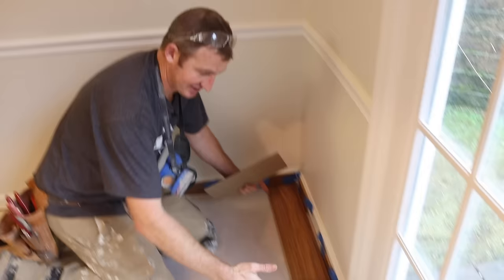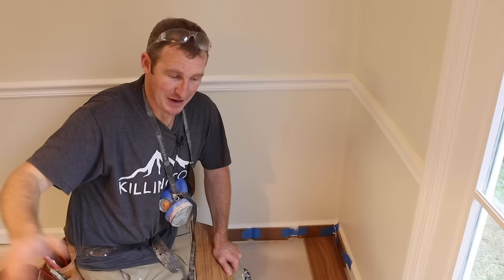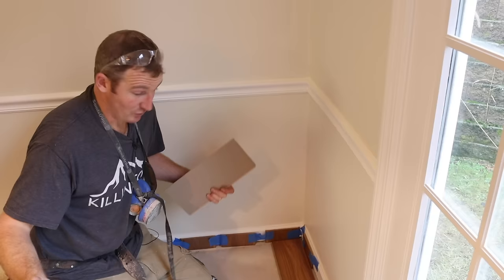Stair casing is essentially just having boards that are 6 inches smaller as you go, and it can go through the whole room. So you see step cracks all the way, and you could basically see the seams all in a diagonal pattern. That's not recommended, because the flooring can move in irregular ways. So random pattern really literally means that, but the biggest rule is just 6 inches away from each seam.